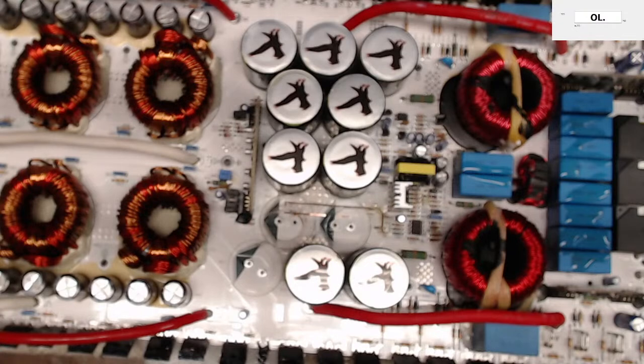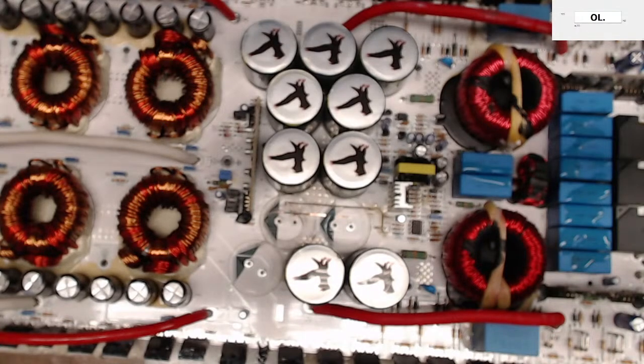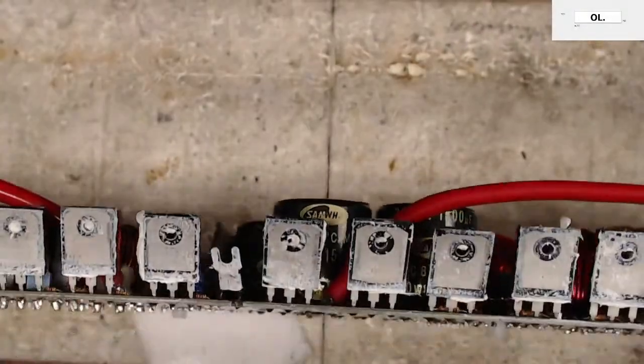As I get thermal paste all over me. So yeah, it's going to be billed as two trace repairs. And I may want to pull that auxiliary transformer though, because those burn marks coming from underneath that transformer are a little concerning. So it'll be two trace repairs, and then I'm going to pull the auxiliary transformer.